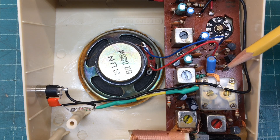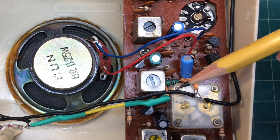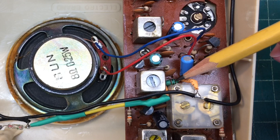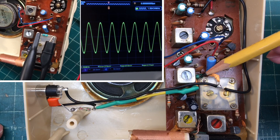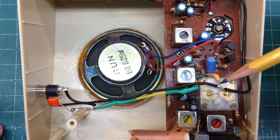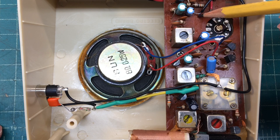This goes back over to the choke — it's a 1/8 watt, 1 millihenry. You can see I'm hijacking the oscillator. I tried a direct connect, but that kills the LO, even with something like a 3 picofarad capacitor attached. So I'm using the choke to pick up the local oscillator through induction. It's mounted at the location on the tuning condenser that gives the highest amplitude, as shown on the scope. I used a little super glue to attach it, and the ground lead routes back to a common ground at an electrolytic capacitor.